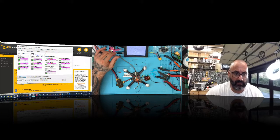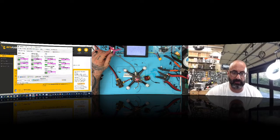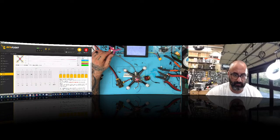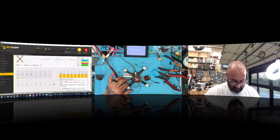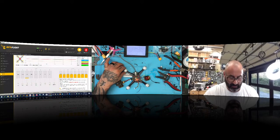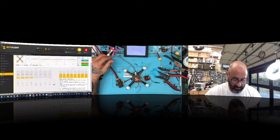Okay, let's see, 10-12-2004, 10-12, that's good, all right. And now we're going to go ahead and take programming off, write that to set up, and we'll see if everything's spinning in the right direction. So let's go to motors. Motor one. Well, that's not going to be motor one, so we're going to have to redo the mapping, the resource mapping. But all the motors do work. Yeah, everything looks good there.